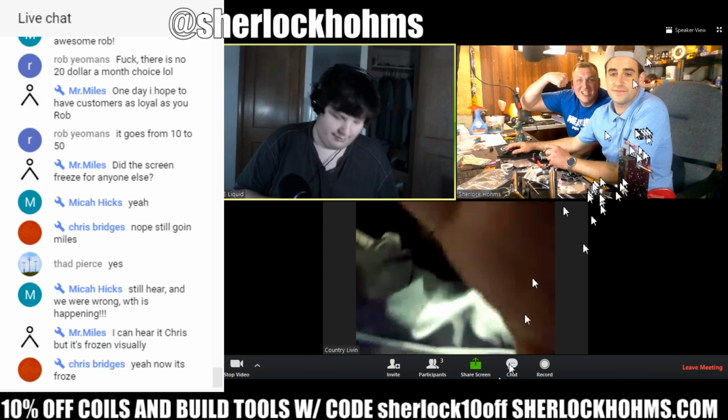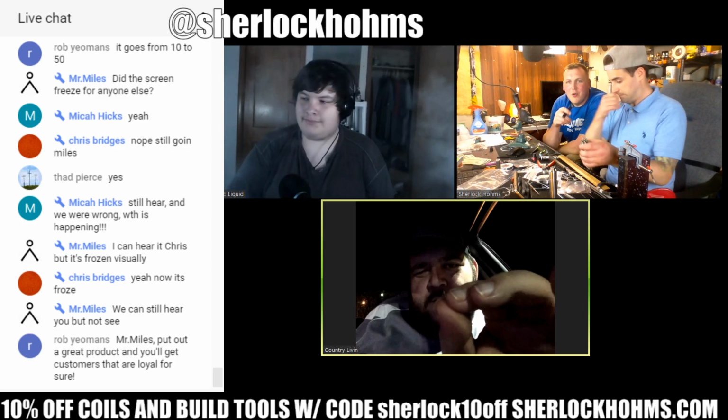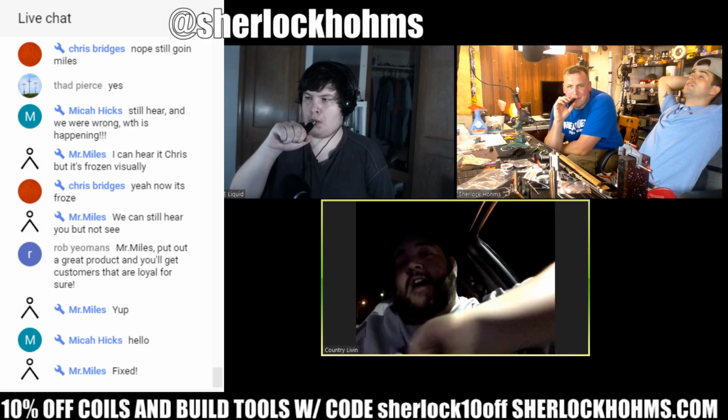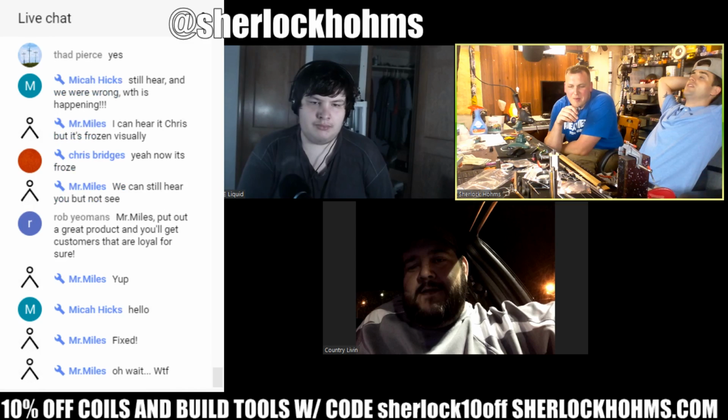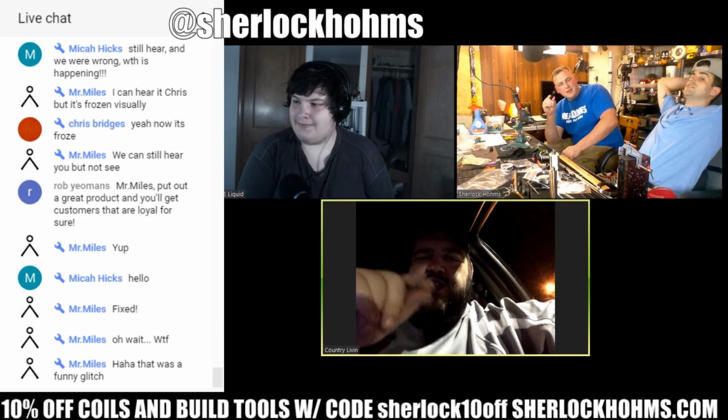What's the result? It actually ohmed out higher than I expected. It's a 0.22. Hold up, your spaced build came out to a 0.22 single? So if I were to put two coils of the exact same coil in there, it'd be a 0.11. How is that possible? Your spacing is higher, by 0.03 ohms on a dual coil. How is that possible? If you look at it this way, when you merge those coils together, that's basically becoming one unit. There's no space between them where it has to travel more. It's got like a shortcut. Exactly. It goes straight instead of curves.